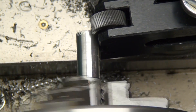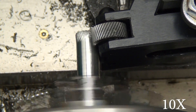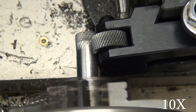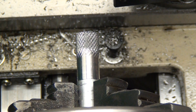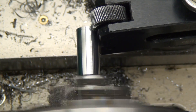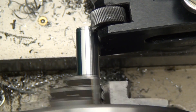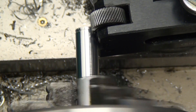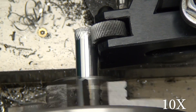You'll notice on this one that I've got the tool canted — I'm pretty sure that was five degrees. Everything else is the same: 25 thousandth step of the cut, 150 RPM, two and a half thousandths per rev. Much better results — that looks fantastic. You want to keep the tool canted at five degrees. It's easier on the tool and better for the material because the tool more gradually engages the material as it starts to push that knurl, and the material won't deflect as much.